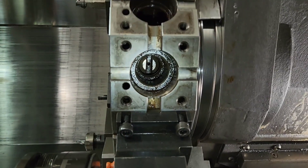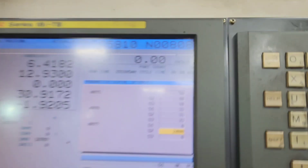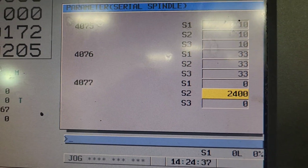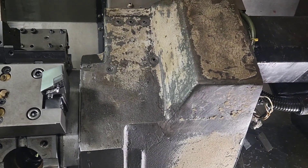The way you adjust that, if that's off, you're going to use parameter 4077 to adjust that. 4077 — this one's at 2400. There it is. Spindle two, if it is a spindle.